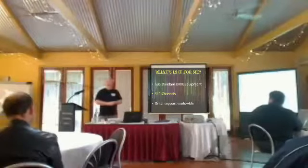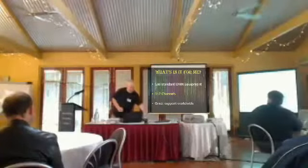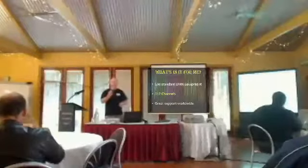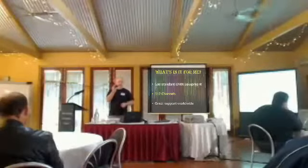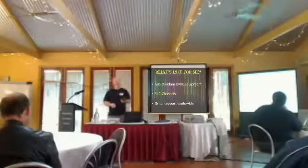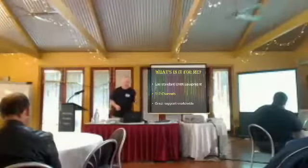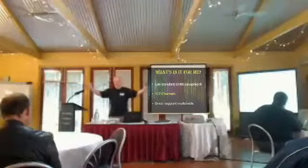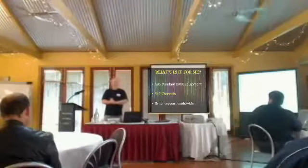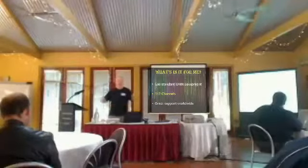DMX will give you 512 channels on a universe. When I talk about a universe, it's the network coming out of there. A single universe of 512 channels. It doesn't have to be 512 channels, it could be a universe of 30 channels. DMX just specifies that there has to be a number of channels, a practical minimum of about 24 channels, and a maximum channel count of 512.